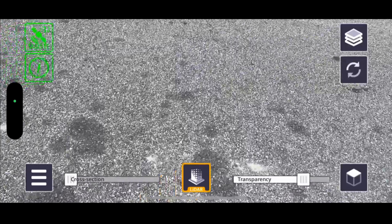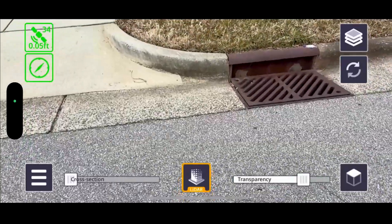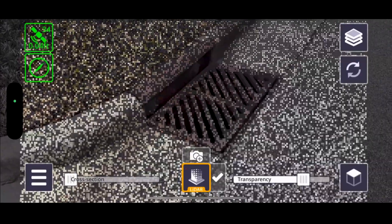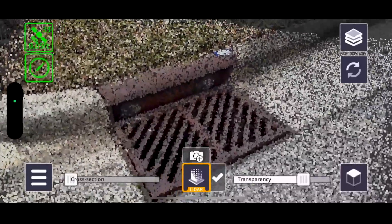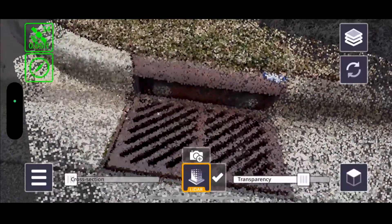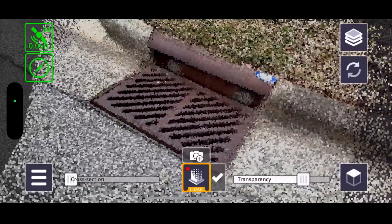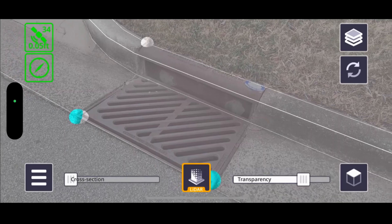I'll walk across the street to the DI and do the same thing. Hit the LiDAR button and move nice and slow around the DI until I feel like I've got a point cloud that represents what I want to pick up. If I wasn't working by myself, I could pop the top off and potentially get down inside it a little bit. Your range is only going to be four to five meters with the LiDAR, so you can't go too far away or do anything too deep. Also, you don't want to tilt it too much either. Now I'm finished — time to head back to the office.